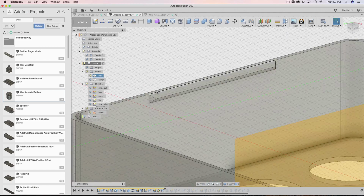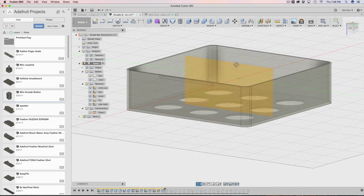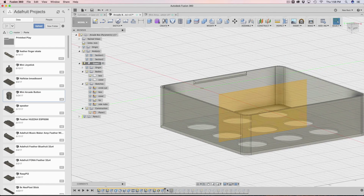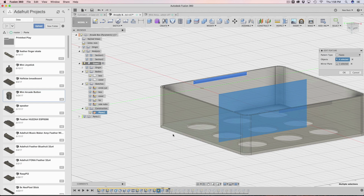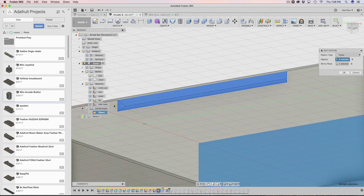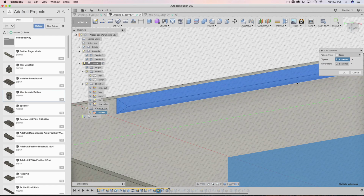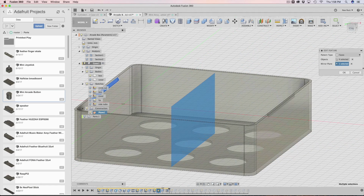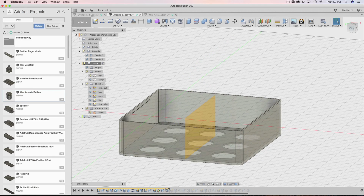The next thing to do is to mirror all of this to this side over here using this guy as my kind of tool. So I run the mirror, I type in S to bring up the toolbox and just type in mirror, hit enter, and then run it. So here's the mirror applied. You can see how it's built. The pattern type is set to faces. I went ahead and selected all the 4 faces, so 2 here, 1 there, and 1 on the side there. And then my mirror plane, I just select that mid plane that we created and talked about. And then I hit OK, and then it applies it.